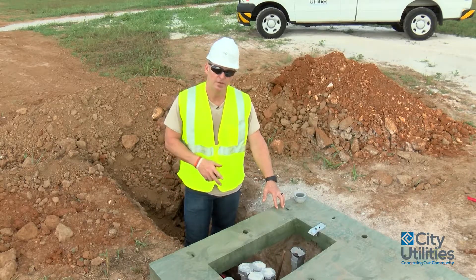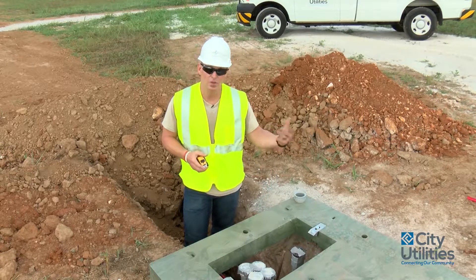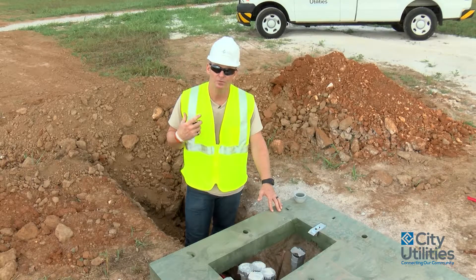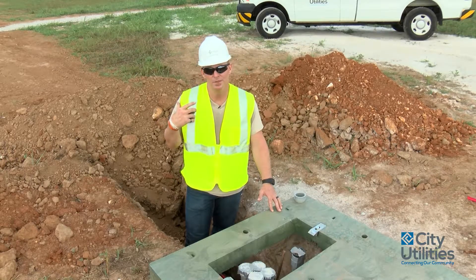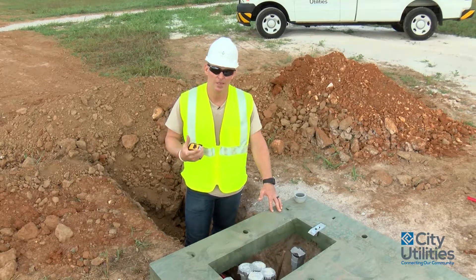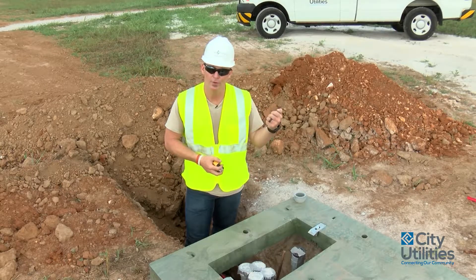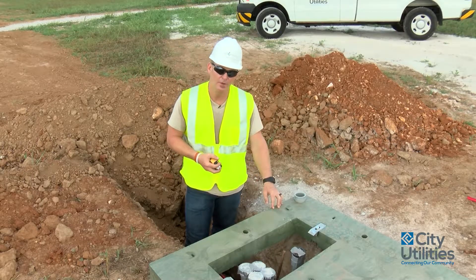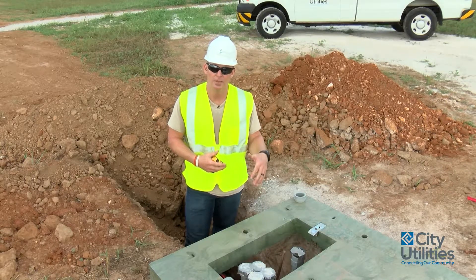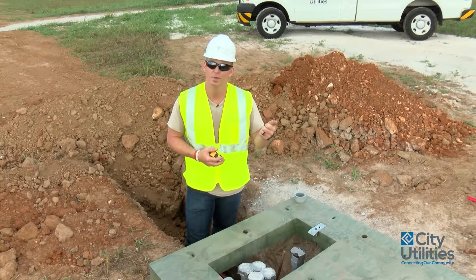There's 36-inch cover over the pipe coming up to that steel in the ground. You may ask why we have that five-foot section of steel — it's because we use large trucks and this is a large run, pulling about 300 to 400 feet of cable. On the other end we have another section with that five-foot stick underground. We use these as anchor points so these elbows don't come out of the ground while we're pulling the wire, because that wire becomes very heavy.